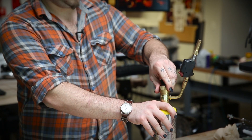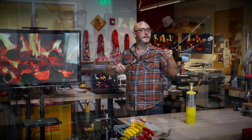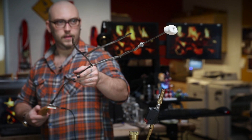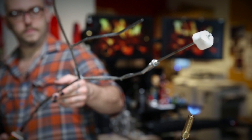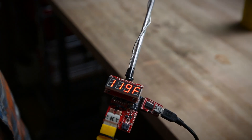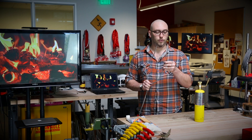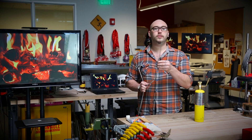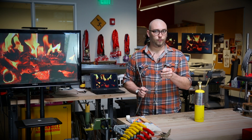A few things to go over with this thermocouple probe. This is the new one that we're selling — it's a stainless steel type-K probe. It's 200 millimeters long, and it's rated up to temperatures of, I believe, 400 degrees Celsius. Now, the datasheet says very clearly not for direct contact with food. I believe that it's safe because this is supposedly stainless steel — it can't have any lead in it because it has to get quite hot, so lead wouldn't work out very well in that situation. What I imagine they mean is that you should not use this in direct contact with food as a food thermometer, and you shouldn't build it into a product where it will come in direct contact with food — otherwise, you probably won't get your NSF rating.